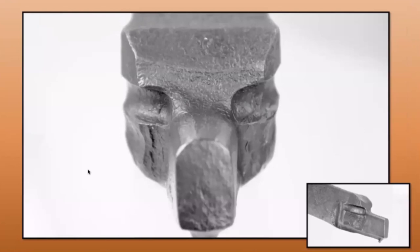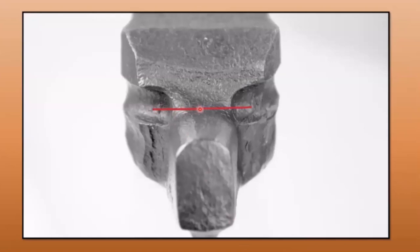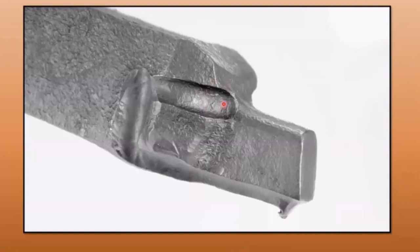We're going to start to put in the eye sockets and we're going to run that back to start to define the top end edge of his cheeks and the back of the cheek, start of the neck and the beard. And again, as we said before, I want you to place the middle of the tool in line with the bridge of the nose. The eye sockets are deepest at the front and feather out as they go to the back. And I want you to run them all the way behind the upset. And then we're going to come in behind the upset and create the beard.